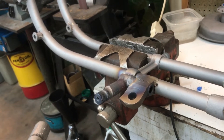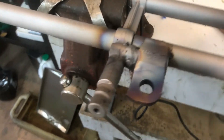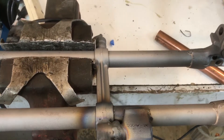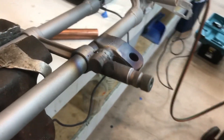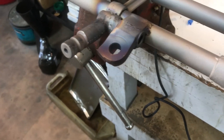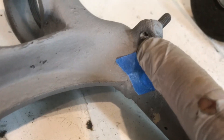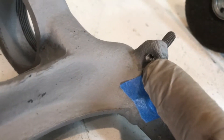I'm going to go ahead and turn my torch off before I burn the house down. Just to recap — I think we are in very good alignment and I'm very happy with that repair. One of the other things I need to repair on the swing arm is someone's welded a bolt to this casting right here. And if you look back here it looks like there might even be a drill tip that got broken off in here. So long story short, we'll have to fix this one up.